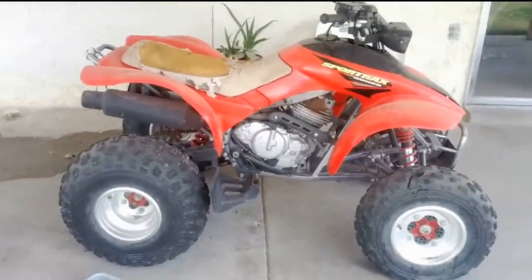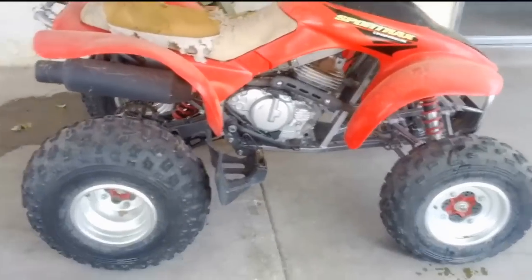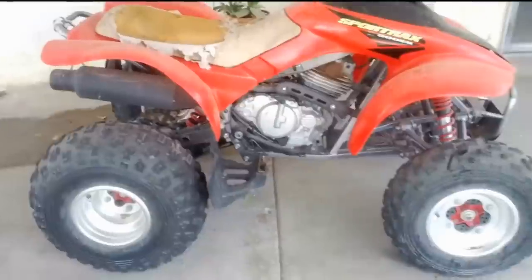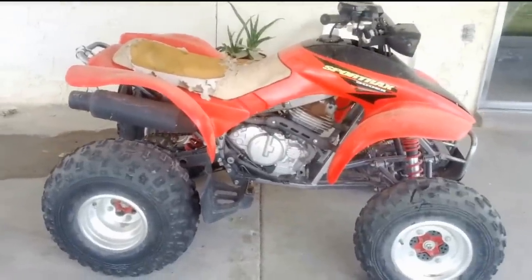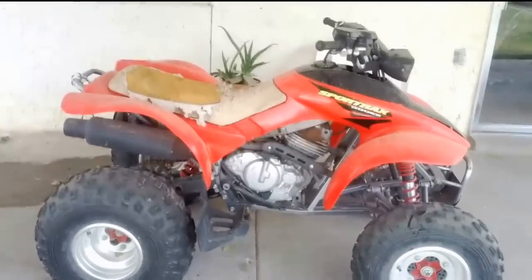Okay, YouTube, this is my Honda 300EX. Something is wrong with the carburetor because it does not accelerate to its fullest. You can start hearing it bog when you accelerate hard. So I'm going to go ahead and remove it and check it out.